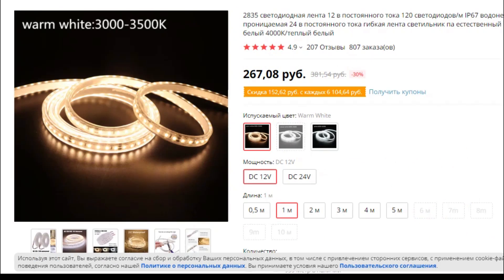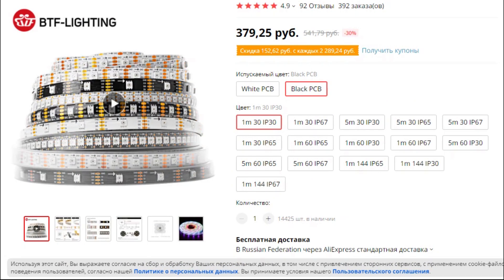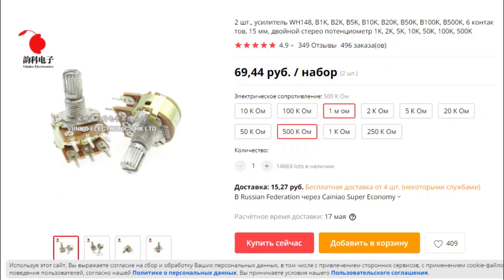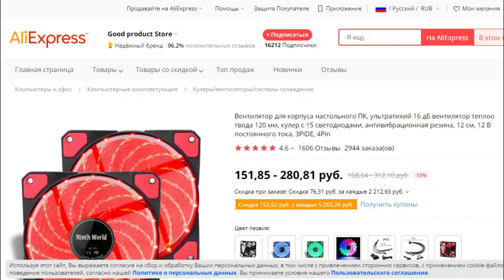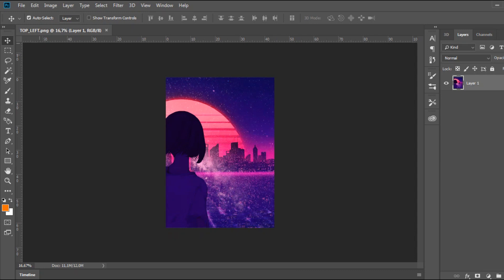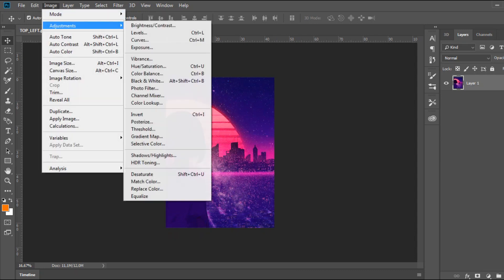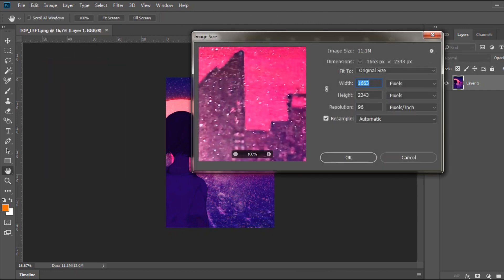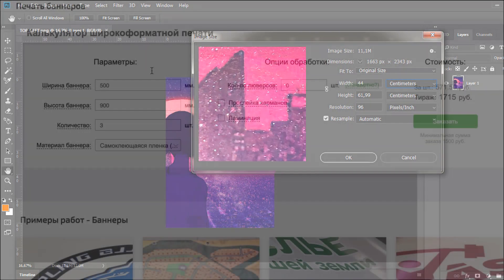We also add a 12V LED strip — about 1 meter — and a power adapter for the sign backlight. We'll also try to make dynamic backlighting, so we get 2 meters of 5V addressable LED strip and a power adapter. And some small extras: buttons, sockets, power cables, maybe a dual potentiometer for volume control. We can also get a 12V fan to reliably cool the internals on hot days. While everything ordered is in transit, we need to prepare layouts for printing on self-adhesive film. We prepare images at 1:1 scale, ideally at 250 pixels per inch, but lower resolution also works — at 96 DPI all my prints turned out excellent quality.